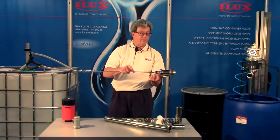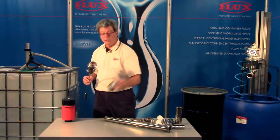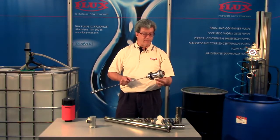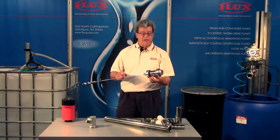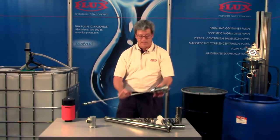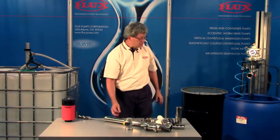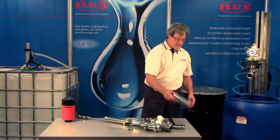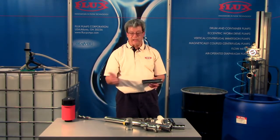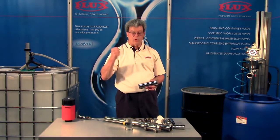There's a mechanical seal up at the top and a gearbox that allows the pump to run at a lower speed. These motors run at 10,000 RPM; this planetary gearbox is a 10-to-1 turn-down, so the rotor is operating at about 1,000 RPM. Additionally, the pump can be furnished with a tri-clamp on the inlet, which allows this pump to be mounted externally — horizontally or vertically.